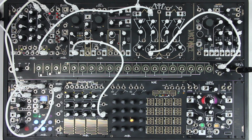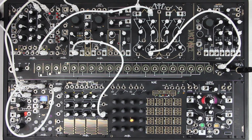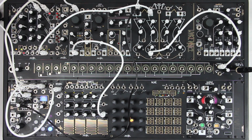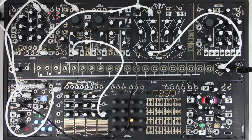Potential configurations are many. Set channel 1 to low pass and channel 2 to VCA and monitor channel 2 output for a classic synth voice. Change channel 2 to high pass for a dual peak bandpass filter.